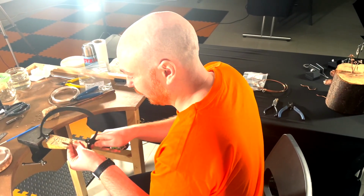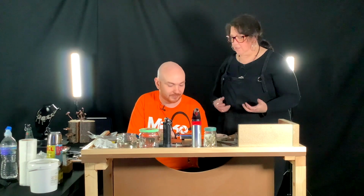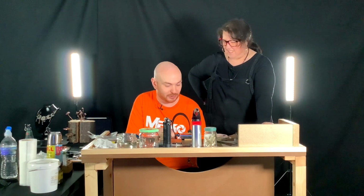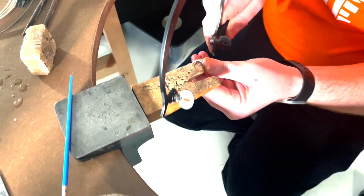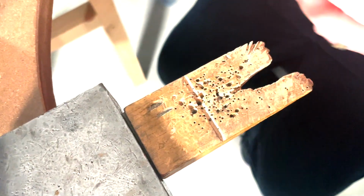And this piece of wood that's clamped on here, I can see we've got a few saw blades already. Yes, this is called your bench peg. The bench peg. It's just used to lean against. It's another tool, like an extension of your hands. It gives you that extra bit of grip. And this will eventually get replaced, I'm guessing, as you get too many saw marks in it. They wear backwards like that. When you're hitting this, then you know, okay, I need to get another bit of wood. But as you can see, there are lots of drill holes and marks, and they're all useful if I'm filing things or if I want to lay something in it.